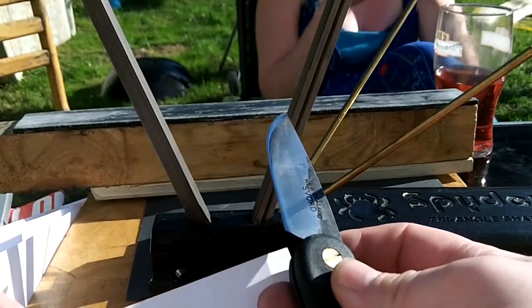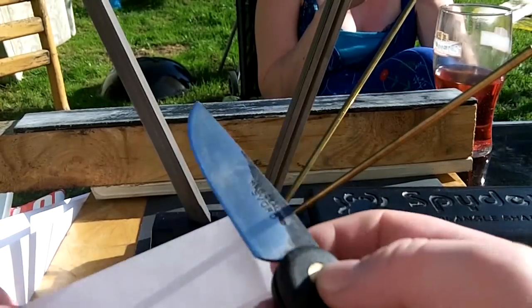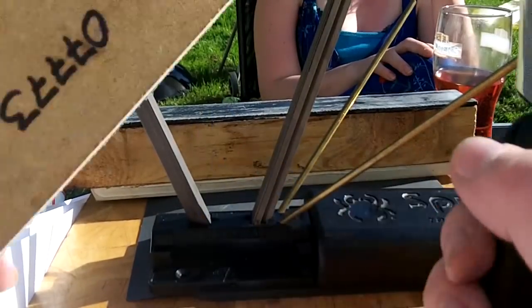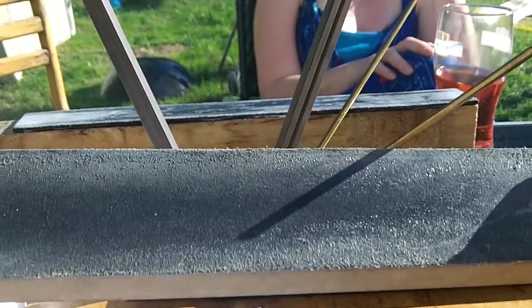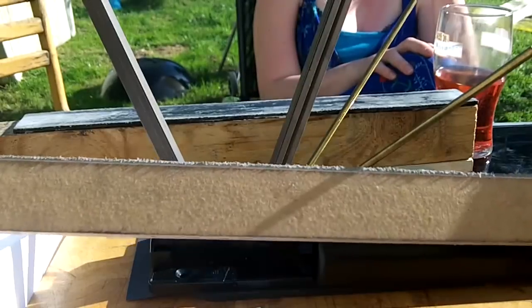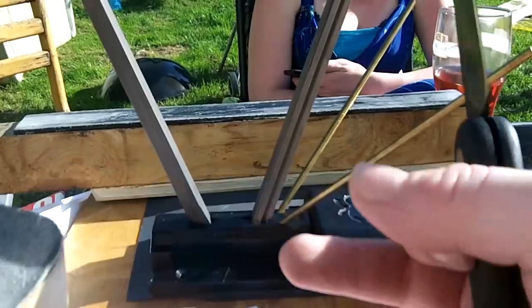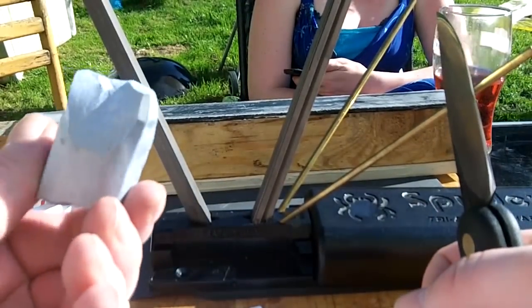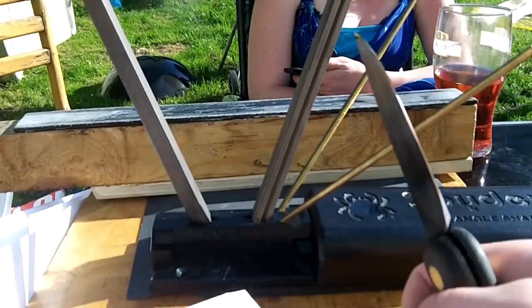So I've gone through the grits on sandpaper, did a little stropping on the Sharpmaker, used the Autosol stropping, and used the Longstrider strop — which I really like. It's a very thin suede leather glued onto a good flat piece of MDF. Combined with the blue crayon-type strop compound he sells, it gives a really, really fine finish.